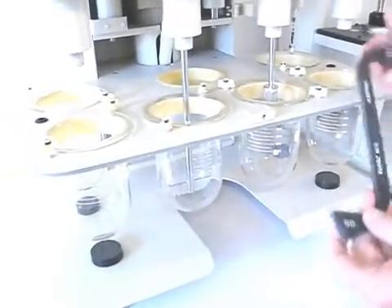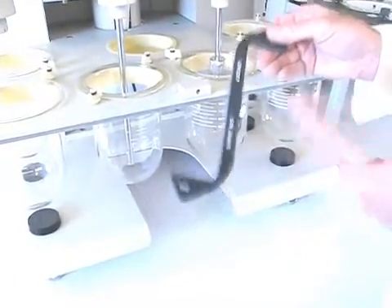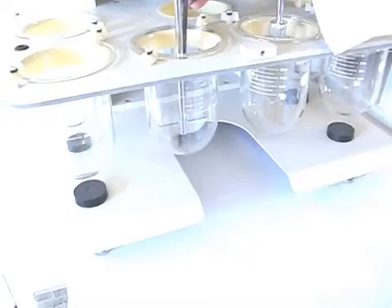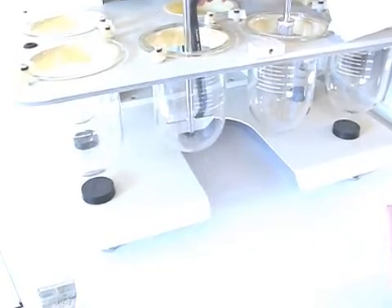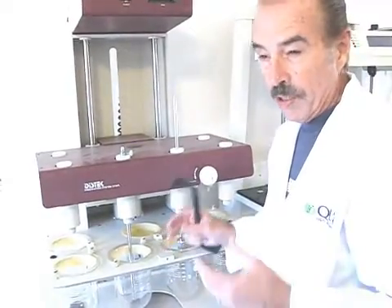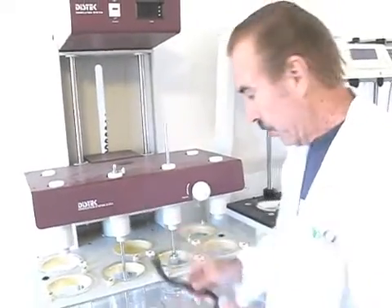One quick way to verify that is with the go/no-go gauge. This is a very fast, simple way of ensuring that you meet the USP requirements. It doesn't give you an exact number, but it will tell you if you're within the 25 plus or minus two millimeters. Starting with the go gauge — it needs to fit under the paddle — and it very easily does. Then we try the no-go, and it shouldn't go, and it doesn't. That tells me this meets the USP requirement. We have another tool — a digital depth gauge — that will measure the exact number. But this gauge is a very quick, simple gauge to use, and it's in the tool kit.